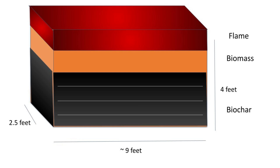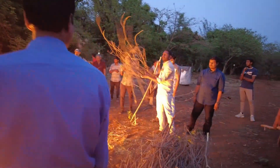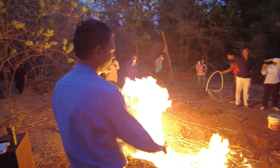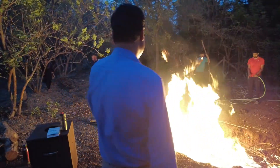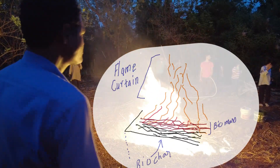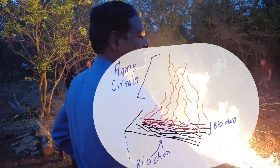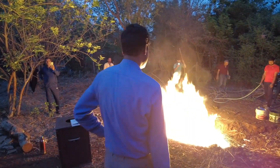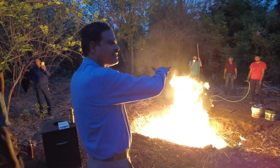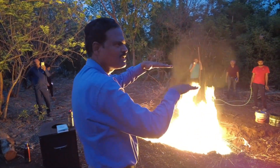Within around 3 to 5 batches of adding layers in this kind of trench, at the end when the top layer is also pyrolyzed completely, we add the water. Here the flame acts like a curtain, and because it is a trench it is protected from external air entering the pyrolysis zone. Whatever biochar is formed in the initial cycle remains there, protected by the flame curtain.